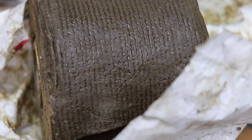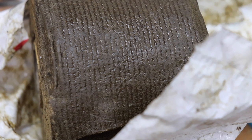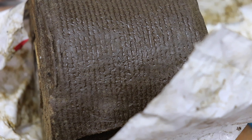You wrap the Denso tape around and then massage in the greasy substance incorporated in the tape. I can tell you that you won't get any water in your connectors if you use Denso tape - it is really the best stuff for waterproofing connectors. If you just use that self-amalgamating rubber stuff, I find that does tend to let water in as well. For things like dipoles where you've got a plug-in connector, a balun, or an RF connector, Denso tape is definitely the way to go. You can use that on any antenna.